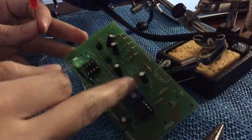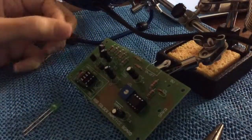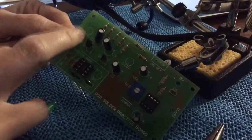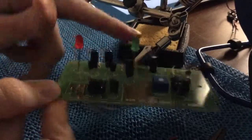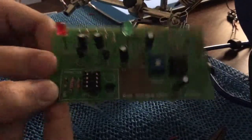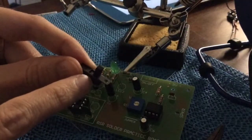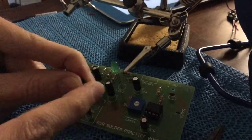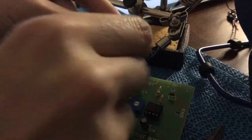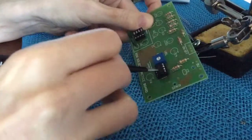So red, green — and remember, the shorter lead is your negative side. There's a flat line denoting the negative lead. I made them really tall so they stand out above the board. There's an image of a closed circuit, so I'm guessing this symbol means on and this means off. I don't think it matters though. I inserted the IC mount earlier, and this is it in order.